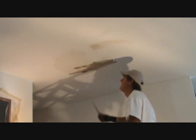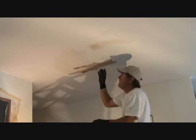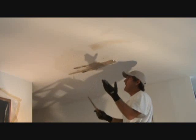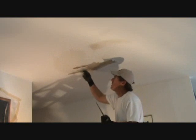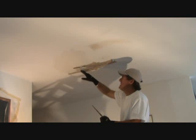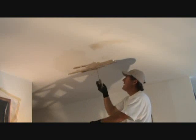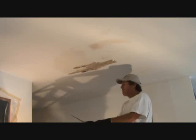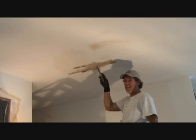I've got my sheetrock saw here. What you don't want to do is start cutting with a saws-all — that's the last thing I would use, because first off dust is going to fly everywhere, and second, if there's any electrical conduits or Romex cables running along the side of a two by four or two by six ceiling joist, you could cut right through them if you're not careful. That's why I always like to use a hand saw. I've already been up there crawling around, so I feel comfortable and I'm ready to get going.